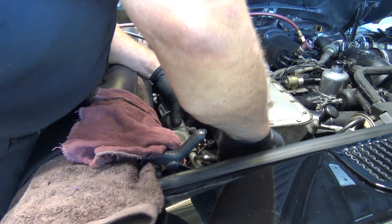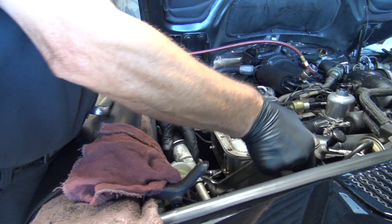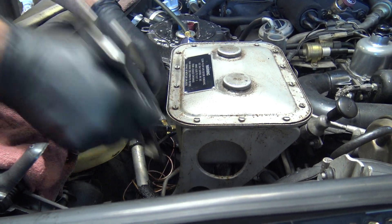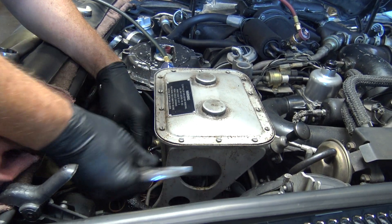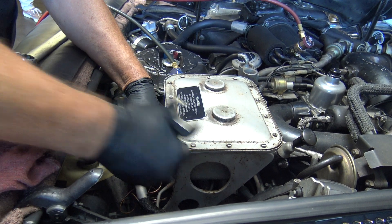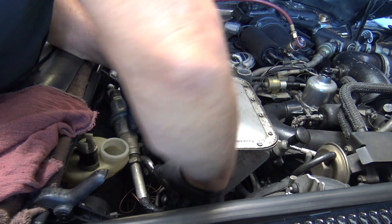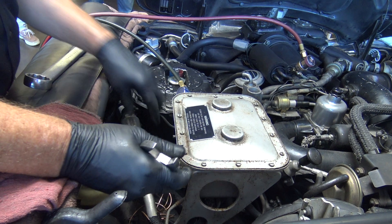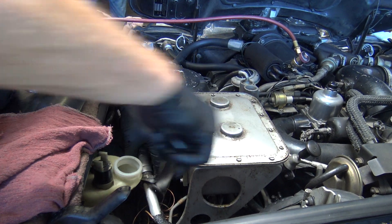This hollow nut here for this fitting has some tight spots — that's probably because it's been tightened pretty tight and it's a little squashed so it's grabbing on the tube. One that hasn't been altered like that would turn freely. This little reservoir right here makes it more difficult. You see that this valve also has a little capillary tube — a capillary tube is just like a little pressure-sensing tube that goes back to this expansion valve, so they kind of work in conjunction with each other.